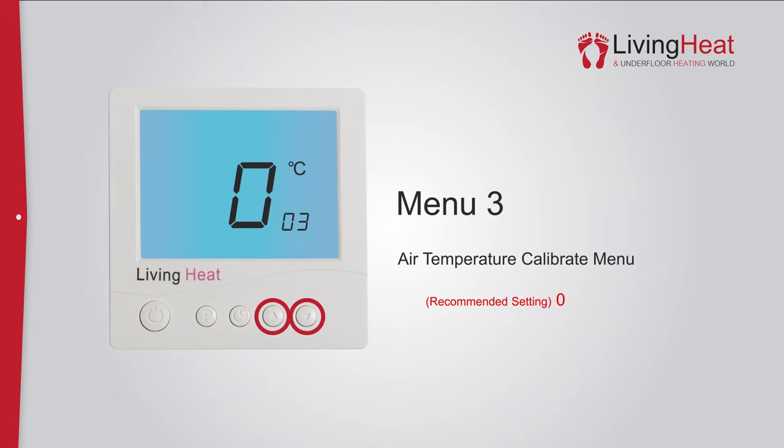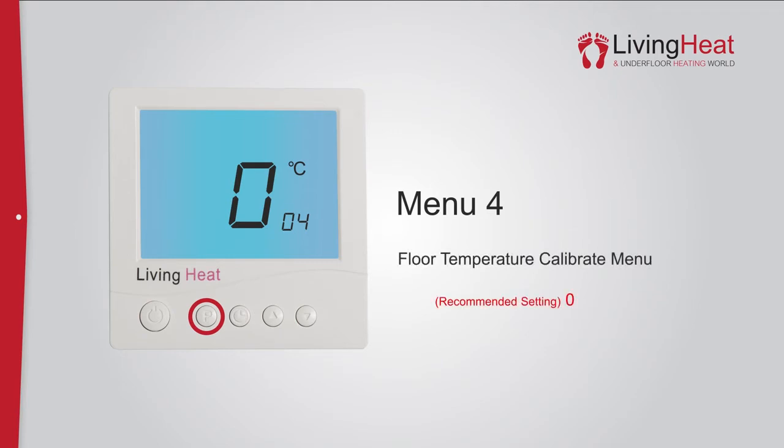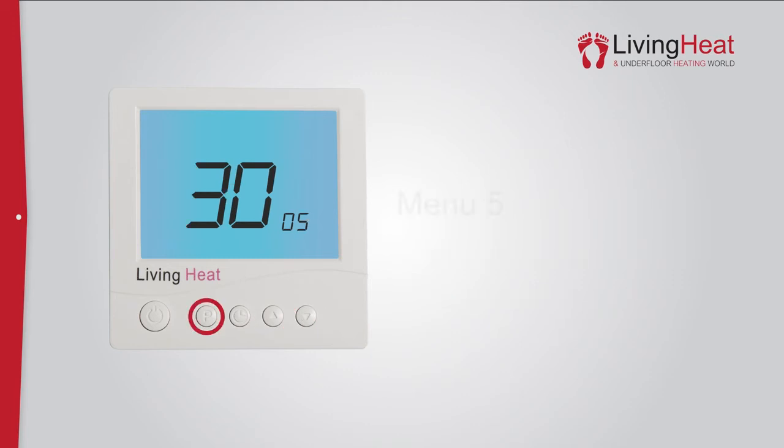Use the up and down arrows again to select your desired setting and then press the P button to move on to menu 4. Menu 4 is floor temperature calibration. This allows the user, like in menu 3, to calibrate the floor sensor should it become inaccurate. Again, like menu 3, unless you're an experienced user of this thermostat, we would recommend leaving this setting on 0.